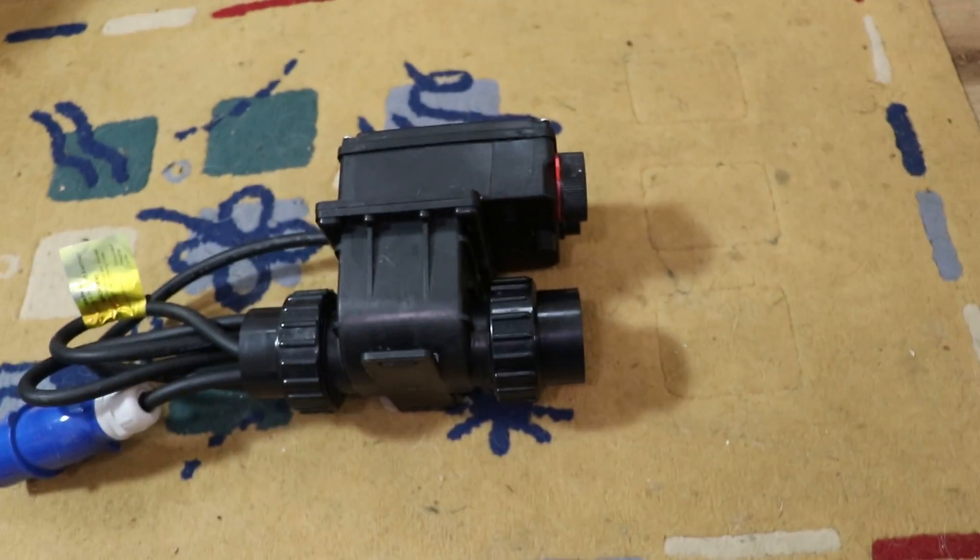That's not where the heaters are wired up. This has got the transfer switch to be connected to the generator manually - that's the manual one. There's also an automatic one in the house. So if we go into the lower part of the basement we'll find another consumer unit. This one's got three fuses in it. This one's a 40 amp one - that is for my main pond's heater. And then that one's for these sockets here, and then that one's for the heater I've just put in. The reason there's a different consumer unit is this one doesn't connect to the generator automatically, so if the electric goes off to the house the power goes off to this consumer unit. It can't be powered by my backup generator - there's no point in these loads being on my backup generator, they'll just stall it. Especially the main 8kW heater - which if it is ever on, and it hasn't been on in three years, it would stall my generator straight away.